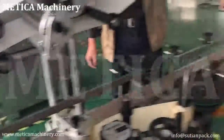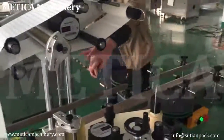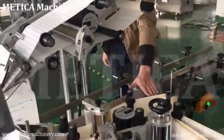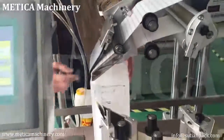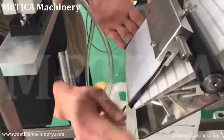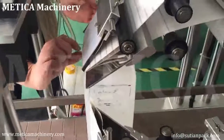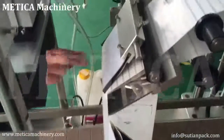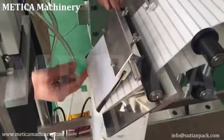To make sure the bottle moves smoothly and straight, adjust the dispenser and this part to ensure proper labeling. Key factors: the angle of the peeling board, the distance between the bottle and the peeling board, and the brush placement.